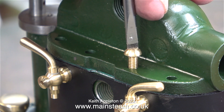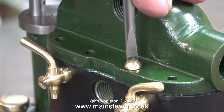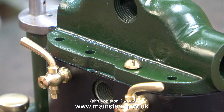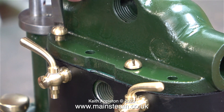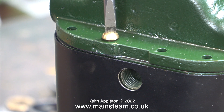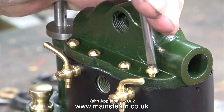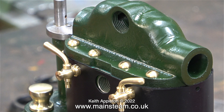To fit the steam chest to the cylinder I'm using more brass machine screws. One of the original bolts was sheared off in position and I know why — the hole isn't as deep as it should be. I fitted the bolts first to see how many were too long, then removed them all and shortened every one using my 1-inch belt sander. Now that the bolts are the correct length I can tighten them without any fear of them shearing off, and very soon the steam chest is held to the cylinder.